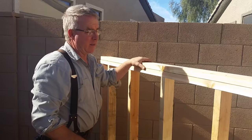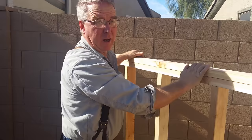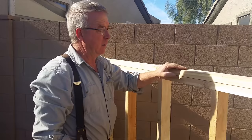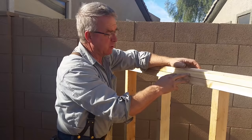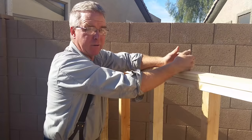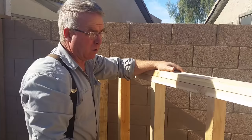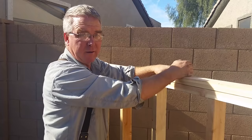We've got a 16-inch layout in the studs and a 2-foot layout in the roof system, which means you're going to have bearing situations happening not over the top of a stud. A single top plate would be a weak little beam. A double top plate is enough to withstand any significant deflection when a bearing member — a truss or common rafter — hits. If you have a point load greater than a single member in a 2-foot system, you'd need a post. But in general, the double top plate straightens a wall, holds it straight, and provides enough strength that you don't care if your trusses miss your studs.